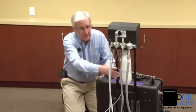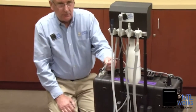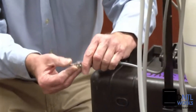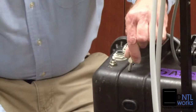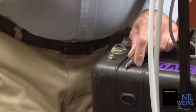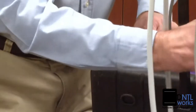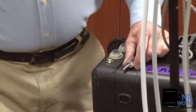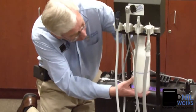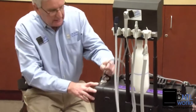Relieve the pressure built up in the air bottle. The fastest way to do that is on the end of the male quick connect — it's like a little plunger that opens and closes. Set it on the side of the cage. It depletes the air faster than holding the button on the syringe. Then disconnect the water bottle, dump the water out, and reattach the water bottle empty. Reconnect the air line.